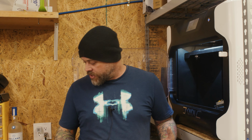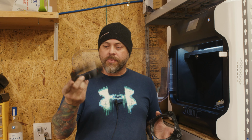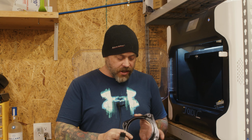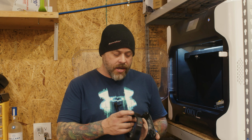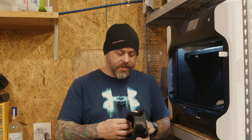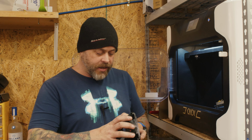And in order to put these things together, I've been working on building it out to a nicer, more robust system. I want a better enclosure for it. So these are some parts that I print that go on the barrel. The print quality came out absolutely fantastic. I do not have this on the finest setting. In fact, I've got it running a little bit coarse, and I made these out of PETG because these are going to be spending a lot of time outside, and they need to be able to be robust and last, where PLA is just not going to quite cut it, and even ABS will eventually break down. So PETG is definitely the better option for this.